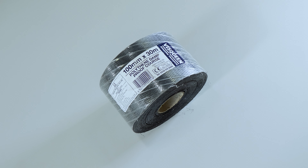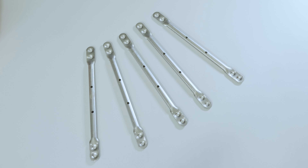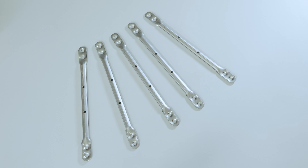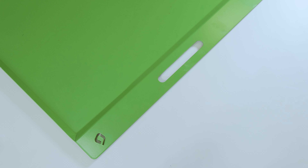We also have a flexible DPC roll and wall ties — these ones are specialist ties for a 150mm cavity, which is what we'll be doing today. They are marked to show where the embedment should go into both masonry skins. Finally, we have a mortar board, which is absolutely essential for anyone working in the brick trade — this one has been kindly donated by Grayson.